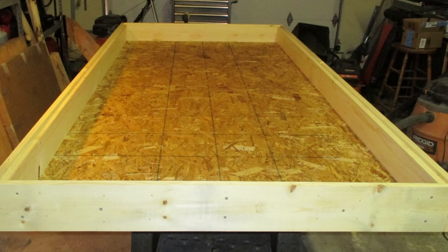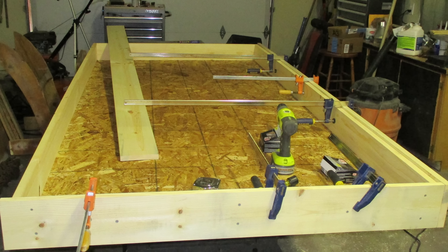You have to build a box to put them in. I used half-inch OSB for the back of the box and 1x6 pine to make the actual box frame. I then took 1x4 pine and mounted it to the inside of the 1x6 so that my half-inch OSB would sit against that 1x4 and I could glue and screw it in. On the front, that also left me a recess for my Lexan to fit into so I could seal it up really well.